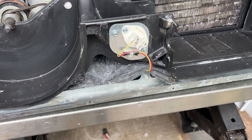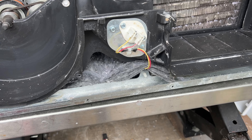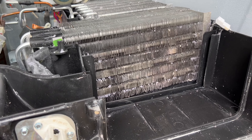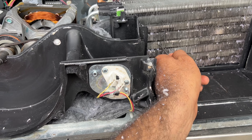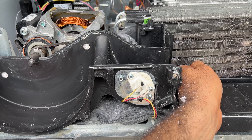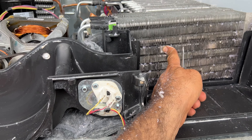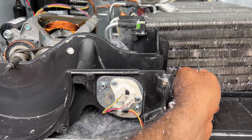See the benefit of having a magnetic drill bit — it really helps. Also, please subscribe to my channel if you want to learn more. I straightened all of these fins — I don't have my fin comb but I'll post a picture of that so you can see how it looks. If you're a homeowner, please be careful not to stick anything in here or damage these fins. You don't want them bent or pinched — if they're pinched they're not going to work the way they're supposed to. Do not use any hard or strong brush on them, just vacuum it.